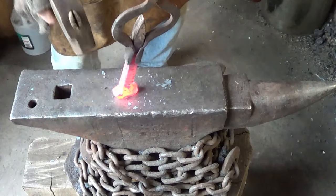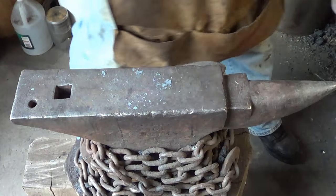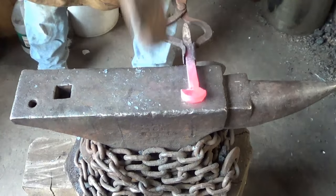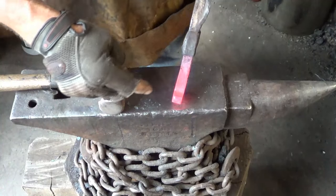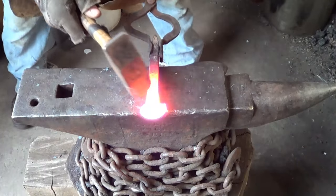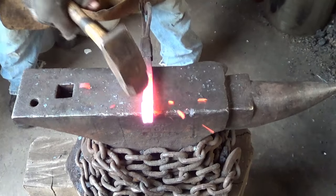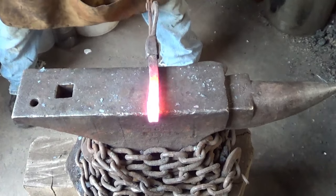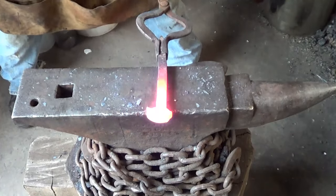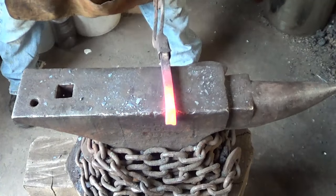All I'm trying to do is push that little roll back into the mass without rolling it over - just kind of upsetting it back. We have a bit of a crease here that I hope doesn't come back to haunt me. What happens if you're not careful is you go to cut that mouth and that little crease drops off and now you're doing the mouth too early. Before I go back to dropping that nose I'm going to stretch out this part here a little bit because we don't need all that mass. For barbecue forks, barbecue spatulas, even garden tools - thin that out so I can have more mass at the bottom.